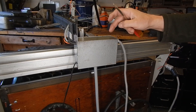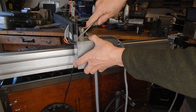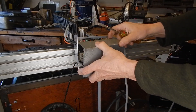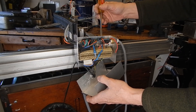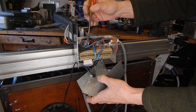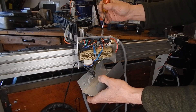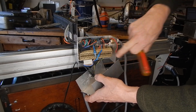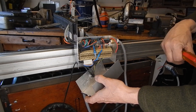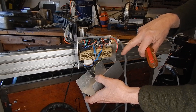One of the first things I did was I replaced the plastic box that was on the back of the Y-axis with this metal project case. All of the leads from the motors and from the limit switches are looped through various ferrite beads that I've collected over the years before they go into this terminal block. This terminal block was something I stripped out of my Bridgeport CNC machine when I converted it to run on Mach3 in a PC.